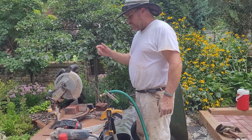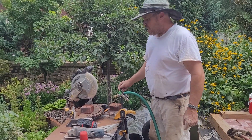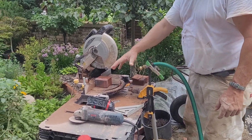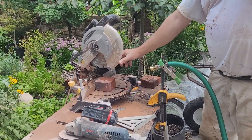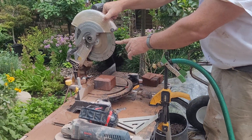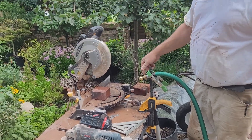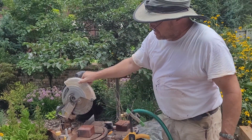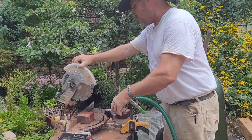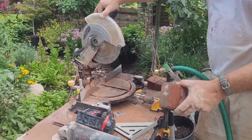This is a technique my son and I have been figuring out — how to cut bricks. What you have here is a cheap Harbor Freight saw that I don't mind messing up. It's a hundred-dollar table saw and I've got the $25 Amazon diamond blade on it — cuts like butter. This is a wet-dry saw blade. I like to cut it wet because no one likes the dust; the dust is silica, it's poisonous, and it's just a better method.